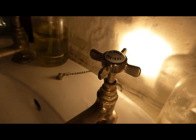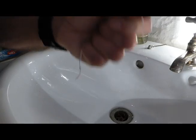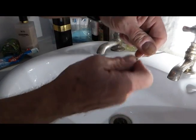So I'll get some tape. Here's a bit of PTFE tape — snap off about four to six inches and just roll it together like so. Then get your PTFE, lift up the gland and just wind it around the base of the tap underneath.